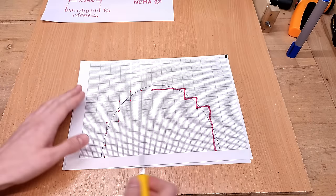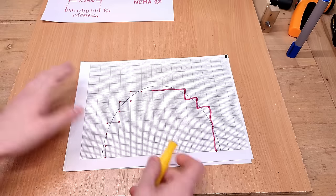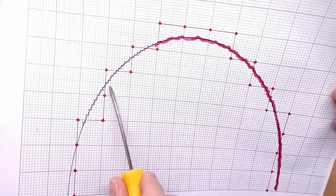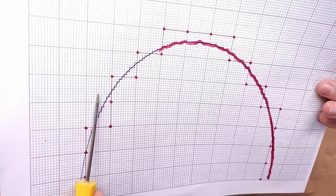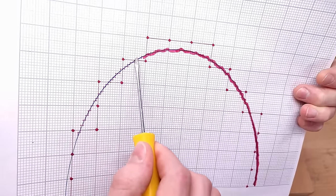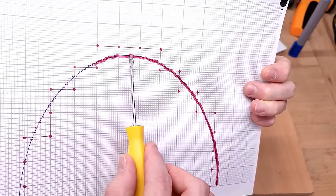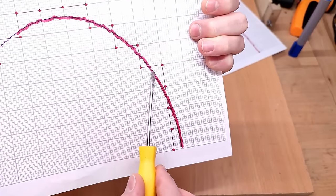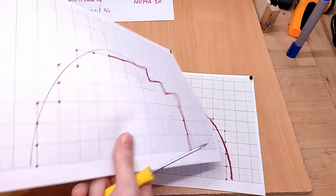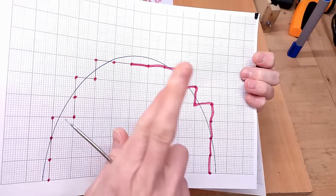If you try to print a small curve, your full step position of the motors might be here and here and here and here and here, and in full step mode, that's exactly where it'll go. But with microstepping basically adding all those tiny little waypoints in between, even if it doesn't exactly hit them, it still manages to sail past those full step detent points instead of snapping onto them like it would in full step mode, and with the addition of inertia, it'll smooth out the motion into a curve that at least closely resembles the one you were trying to draw. Without microstepping though, all the controller can do is pick the full step positions closest to where it should be and hope for the best.